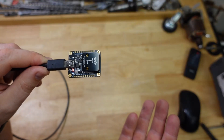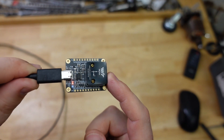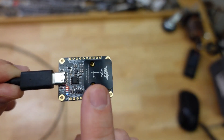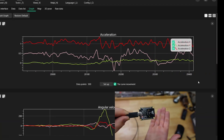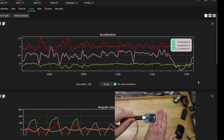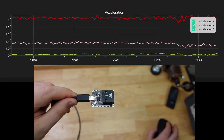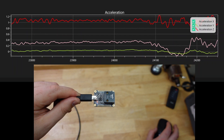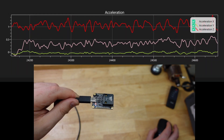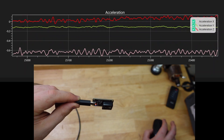The drills we're testing today will also have some kind of accelerometer-based system — a little accelerometer chip inside. Basically they'll be using the data from the accelerometer as the drill moves to work out when the movement patterns change and then cut the power. They might be basing that on just acceleration — as the drill's moving, it'll suddenly jerk, and then something like that will trigger the braking.